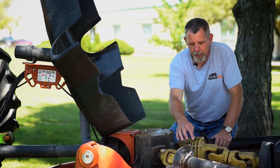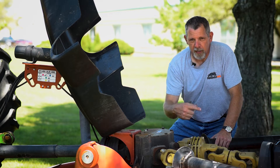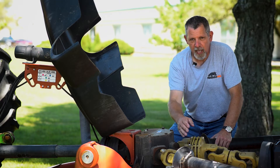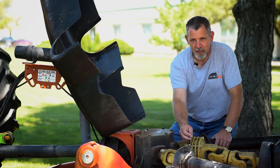We're going to mark each plate with a paint pen. We're going to loosen up each of these nuts, jump in the tractor, turn it on, slip the clutches, make sure our line doesn't intersect, and come back and reset the bolts as per the specification from the factory. So let's get started.